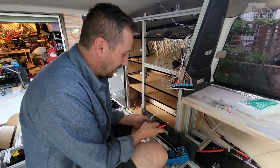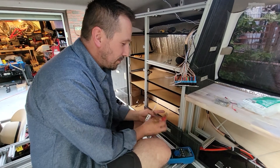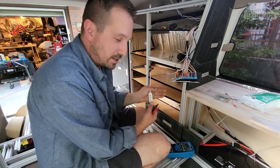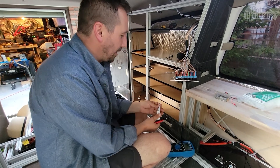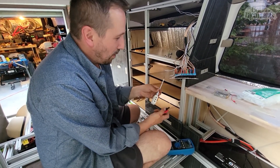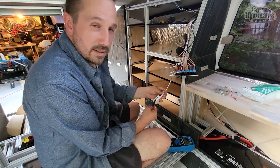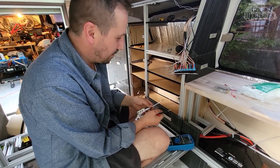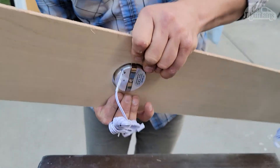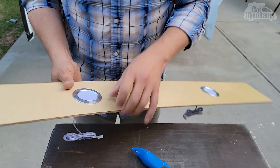The diode tester wasn't reading one way or the other, which might mean that these have a protection circuit that prevents reverse polarity. But this is the driver for it, so if I hook this up to 12 volts I can come to these pins and see which one's positive and negative. I actually had to do that last year when I was putting together Marilyn's van, so I'm going to do that this time as well.